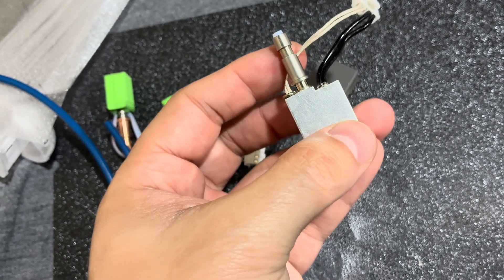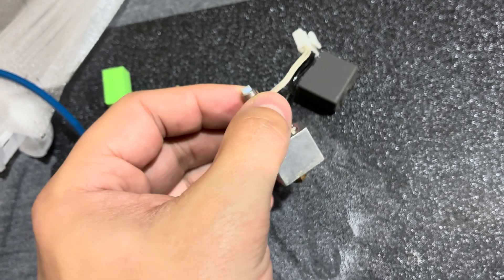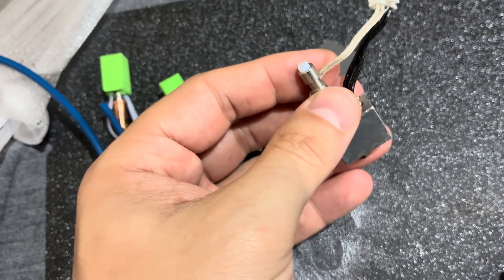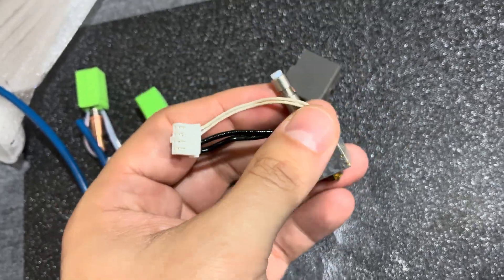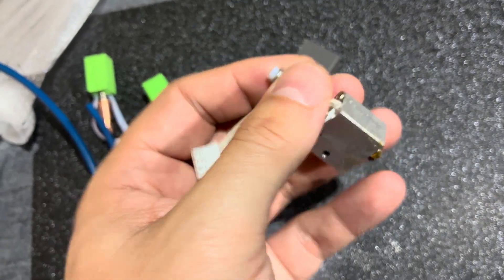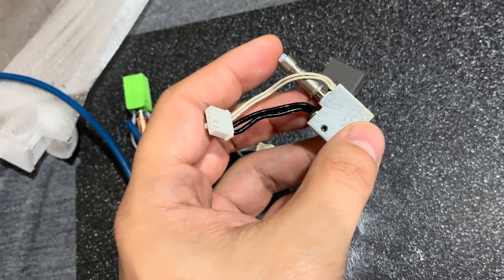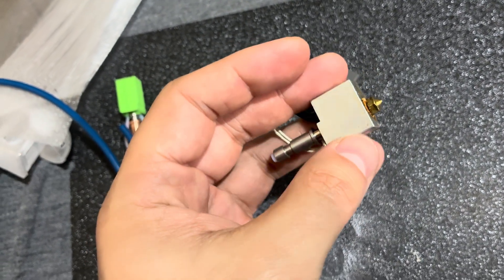It should not be deforming at 270 degrees Celsius. This is not a safe PTFE tube-lined hotend to use at higher temperatures, yet they market it at 320 degrees Celsius. That makes me very wary, because when Teflon is at its melting point or starts to degrade, it's not something you want to be around — it's worse than ASA or ABS fumes. You don't want to be breathing it in. Other third-party hotends may not even use the ceramic aerospace composite — it could be a regular PTFE tube run up to 320 degrees Celsius, which is very dangerous.